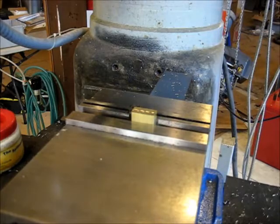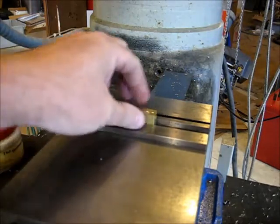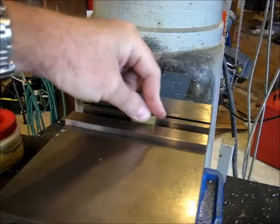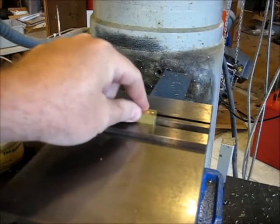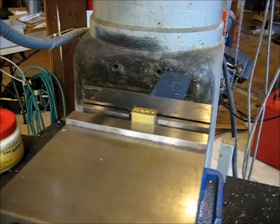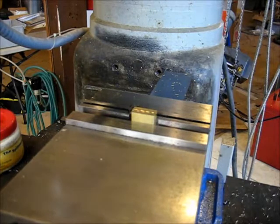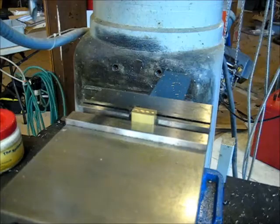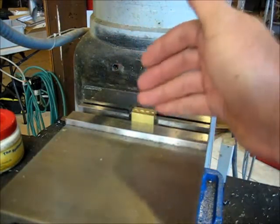All right, the next, we got a part in here. Remember, mark side to the back, 0, 0 is right there in this corner. And the first feature we're going to do is going to be the biggest. That's going to be the tap size hole for the 1/8 pipe tap, which is a size 332, which is a Q drill. Center drill there, or spotting drill. If you look at your drawing, that hole needs to be in the middle, so we're going to go 250 from this side, from the back, remember?